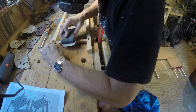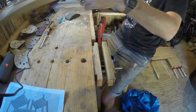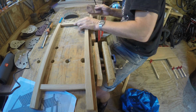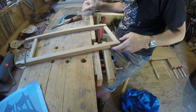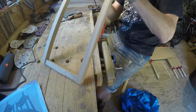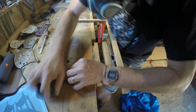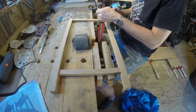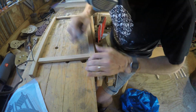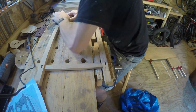So spending a lot of time there in those little joints, those little corners, because that's a real problem, because that's where the glue gets squeezed out and you can't get your sandpaper in there very easily. As I'm sat here now, I'm thinking maybe there's something I could do with like tape or something when I do these sorts of joints. And obviously I had to put a lot of glue in there as well because my mortise and tenon joints weren't cut properly really, because I made my tenons too small because of my chisel size. But that was something that I learned, which you'll have seen in a previous video.